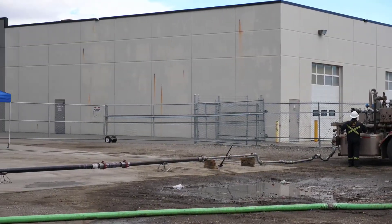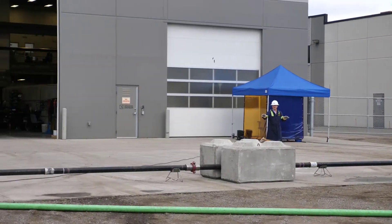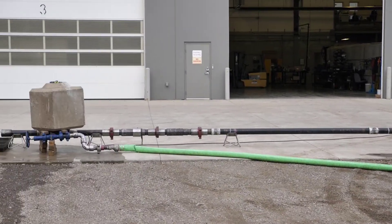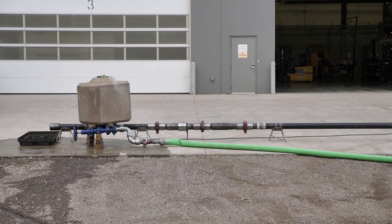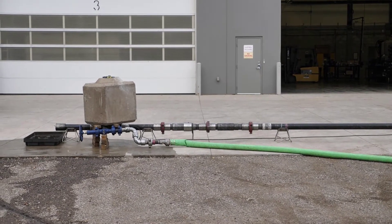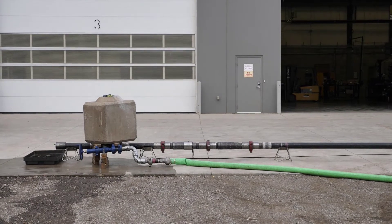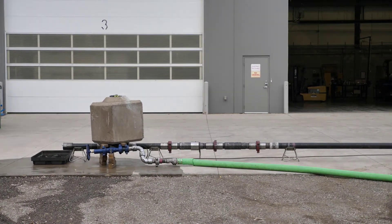The positive test result will be that we don't open any of our sleeves — that would require exceeding 250 PSI per sleeve to open them. We'll get our pump going at a thousand liters a minute and launch the dart. Nothing too exciting happening.